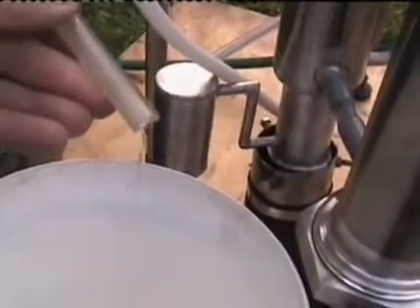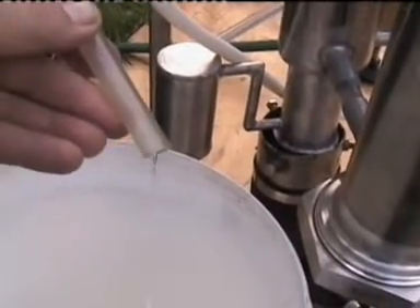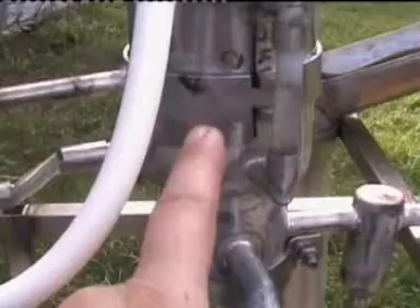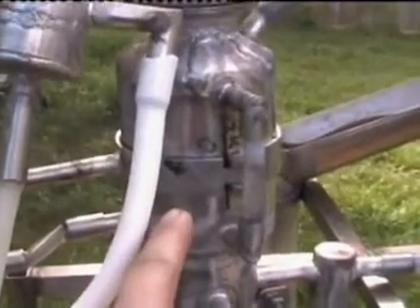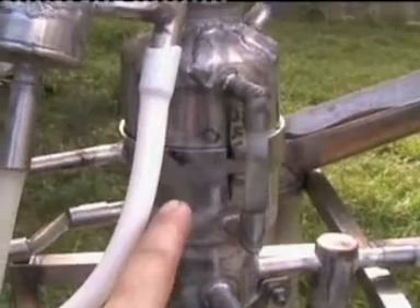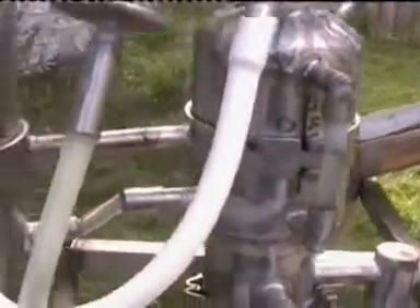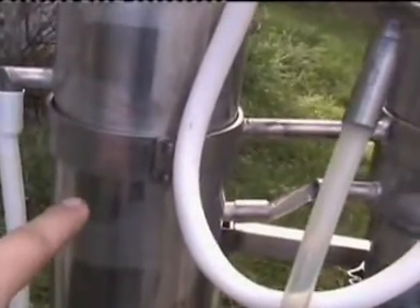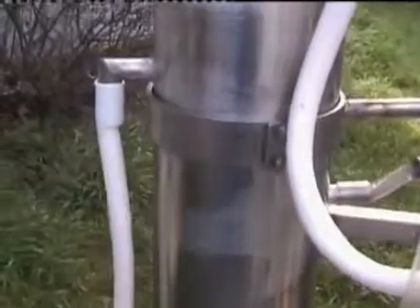You can see it. It's not adjusted yet, and I would say it's somewhere around 80%. What about the water trap? When the spirit comes into the boiler — and as you remember, there's a double-walled boiler — inside the volume of this boiler there is only spirit, and outside it actually separates the water. So the water comes into the water trap, and because there's a similar level, the water is constantly reduced.